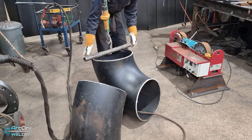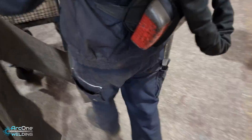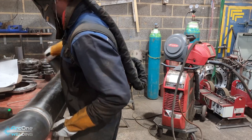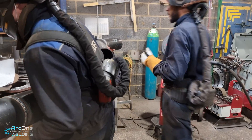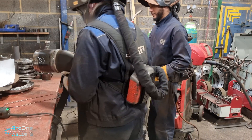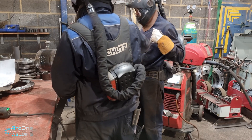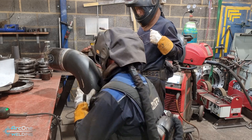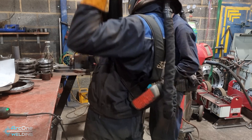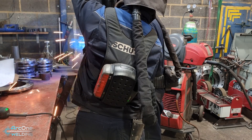Most of the 45 had to get chopped down in order for the set to be fulfilled. There are many ways of doing it. I've seen some guys, on a 130mm set, measure the inside of the 45 and mark half of 130, then measure the outside and mark 130mm, then take it to the saw and chop through the top mark down to the bottom mark.